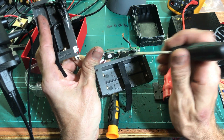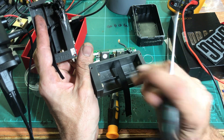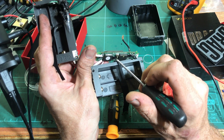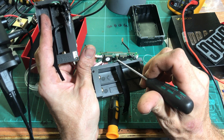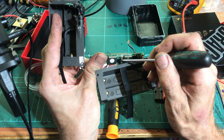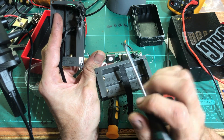On the back here is all the heavy duty stuff — two big inductors, and you'll have two MOSFETs, though often a lot more, sometimes four or even six. The MOSFETs are basically switchers — they're doing switching. The inductors and these little capacitors are energy storage. The components are actually scrubbed off as well, so there's no identifying marks on here. I won't be able to look up a data sheet for these and see what current capacity they are.